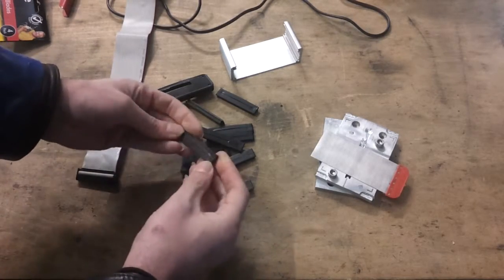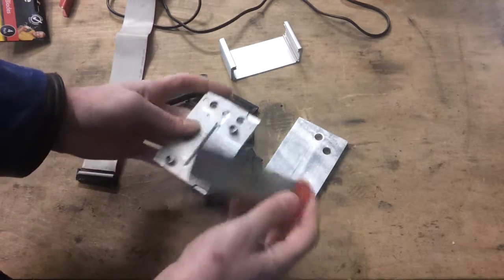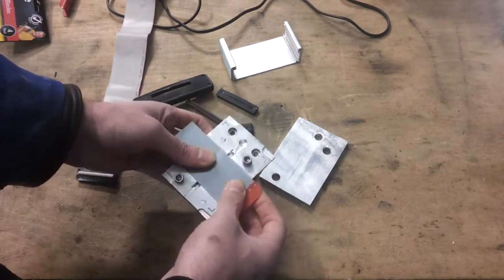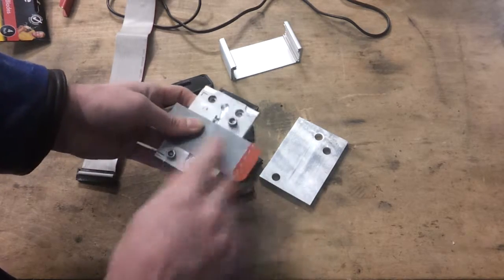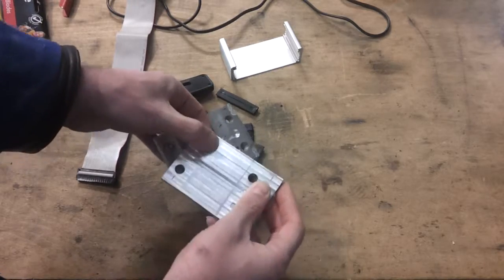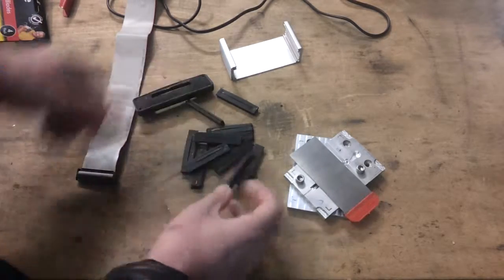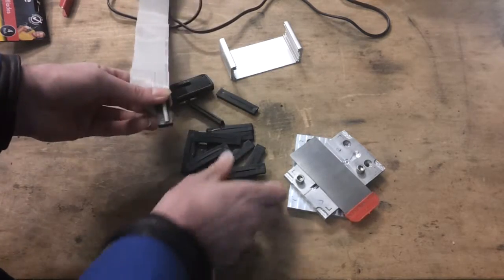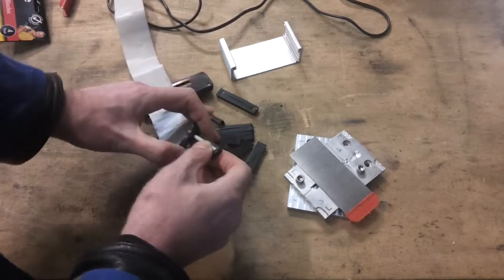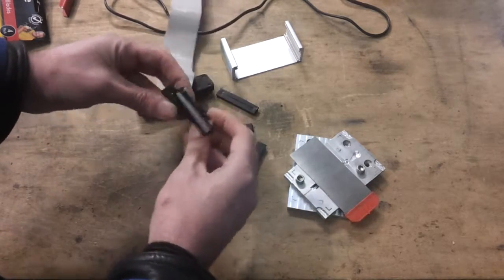I've moulded off a few dozen of these and they're not too bad. I think the reason I was getting a bit of flash down the edges is because this shim has shifted at some point — I can see some marks hanging over the edge here. Clearly a quarter of a mil lip is not really enough to hold that in place. If I do this sort of thing again I'm probably going to have to find a way of locking this in a little bit better. There's just a little bit of a ridge there — that would explain the flashing. But they've peeled off quite nicely and I think they're fit for purpose. So let's try a dry fit. I think this cable is a little bit bigger than the one intended for use, but it does seem to fit — so that's okay. It's not bulging out too much.